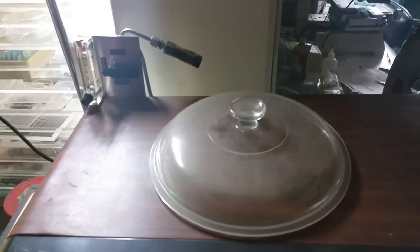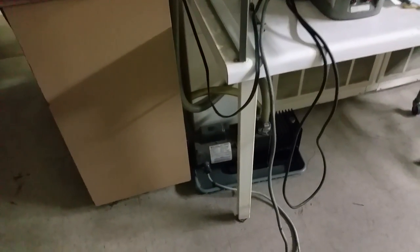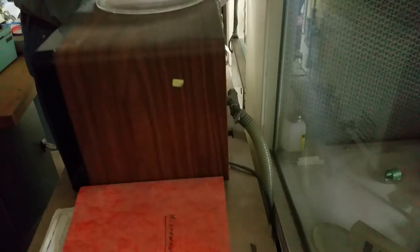And what is this — a vacuum? To draw a vacuum on it. You need a hose that won't collapse. That's going down to the pump on the floor — that's the vacuum pump. This is a submicron vacuum pump. It's vacuuming the inside of the bowl. The inside of the bowl is under vacuum, and this is the other side reading the vacuum. The microscopic amount of atmosphere — remember, our atmosphere is 1% argon. When argon is a plasma, that's what's making the pink color — the 1% argon.